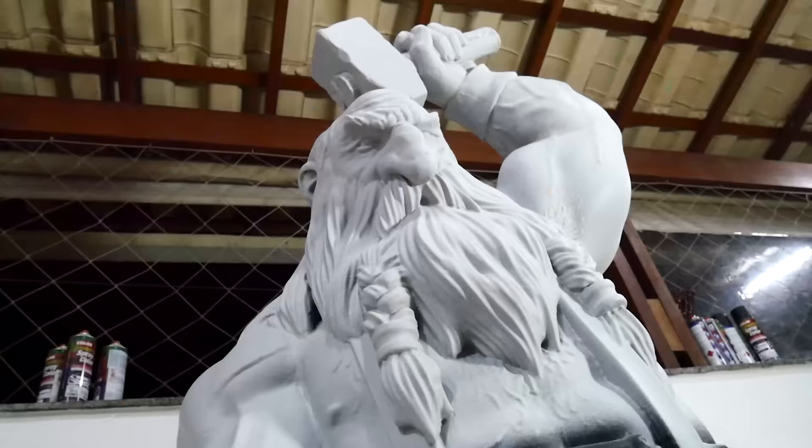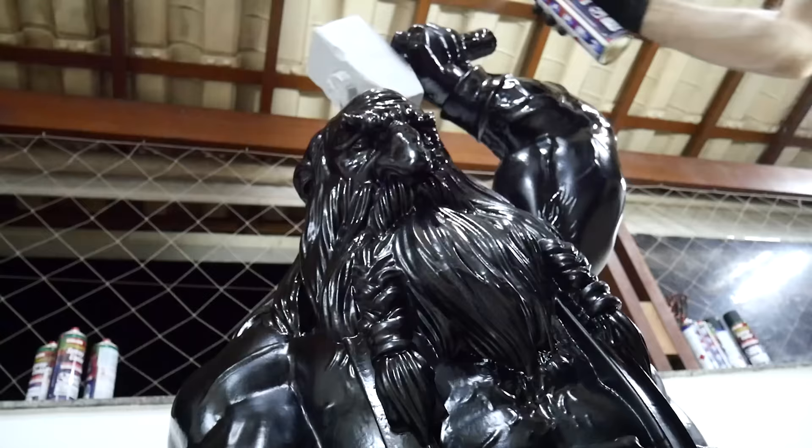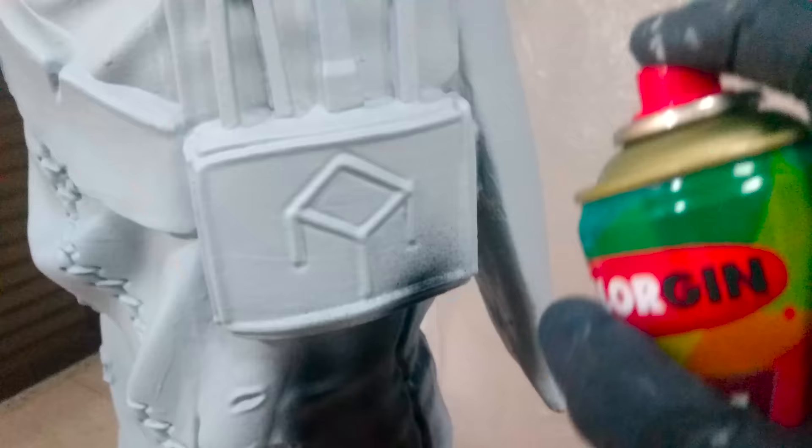To prepare for the next step of metallic painting, we decided to use a black background throughout the piece, and approximately 2 to 3 complete coats were applied using black automotive spray, emptying a total of 6 cans of paint. We also added some final touches, using grit 400 sandpaper to have a perfect surface ready for the painting step that Marcia did.